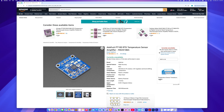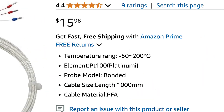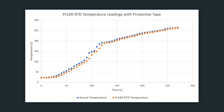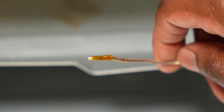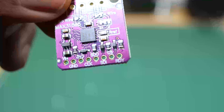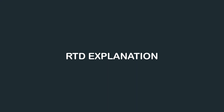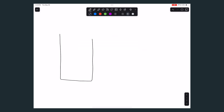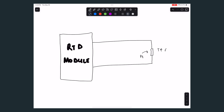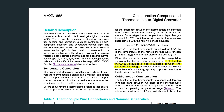Honestly, we were ready to give up until we came across a PT100 RTD module. It could measure the temperature range we needed, but the cable was only rated up to 200 degrees Celsius. After removing tape around the sensor, the readings became much more responsive and far more accurate than the thermocouple. A PT100 is a resistance temperature detector — unlike thermocouples which generate voltage based on temperature differences, the PT100 works by measuring the resistance of a tiny strip of platinum. As temperature rises, resistance rises too, and it varies almost linearly with temperature. Thermocouples have a non-linear response, but the IC assumes linearity, giving wrong values at high temperatures.